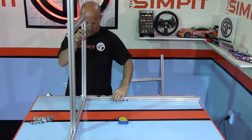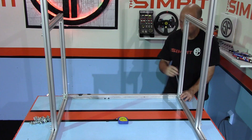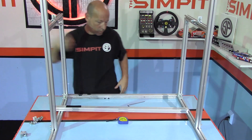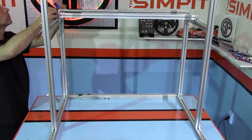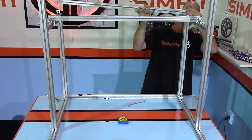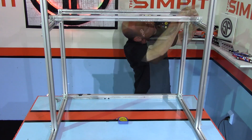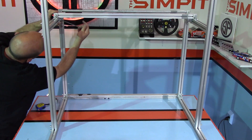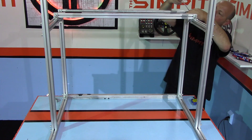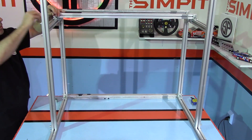In the first steps I added the extra piece of hardware at the back slot — I can now use that hardware to add the first cross brace joining the two sides at the very bottom in the rear, making sure it is square and tightened down enough to prevent it from falling over. Across the top I will add two more cross braces, each 36 inches in length, installed at seven and a half inches forward from the back of the stand — this is the width of my computer and allows for holding it. I use four 90-degree brackets to fix it into position, and the rear 36-inch cross brace is held with two 90-degree brackets and their hardware.